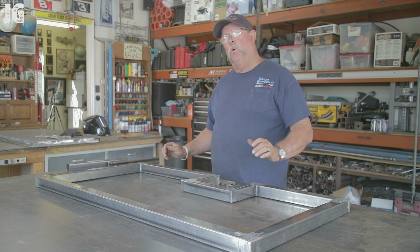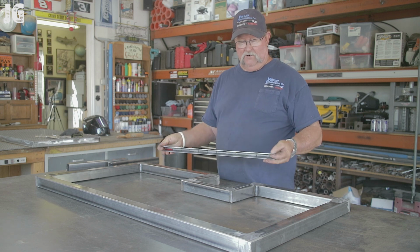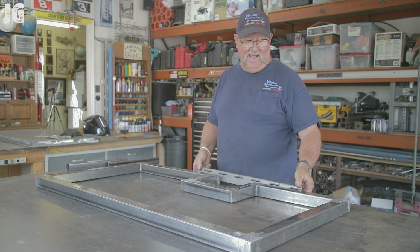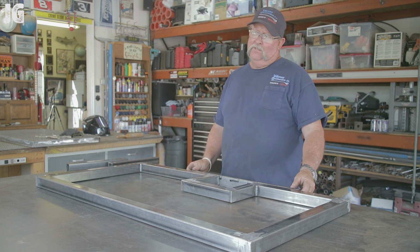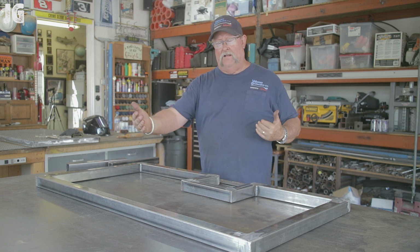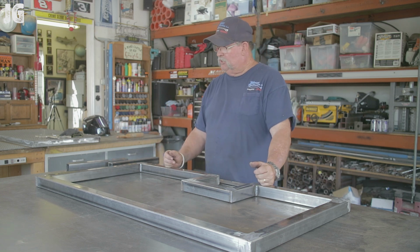And I didn't know what kind of hinges I'd be using at the time. And these are the ones I decided to go with. And they're pretty big size piano hinges here. But they also total about 5/8 of an inch thick here. And so that is the difference on the end here when I welded these hinges on. You know, I thought about it and I measured that door, and when I put this one next to it and found out that it was much wider than the opening I had, I'm actually going to have to cut this thing down about 1 inch.